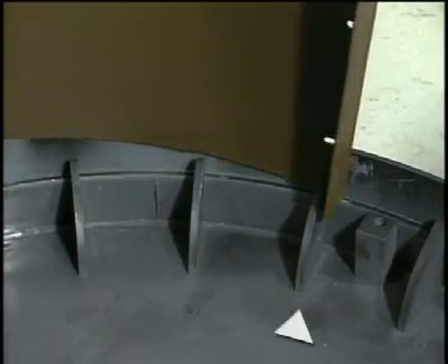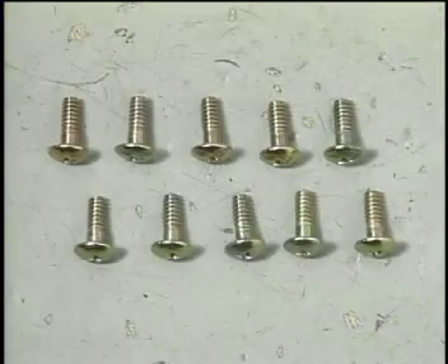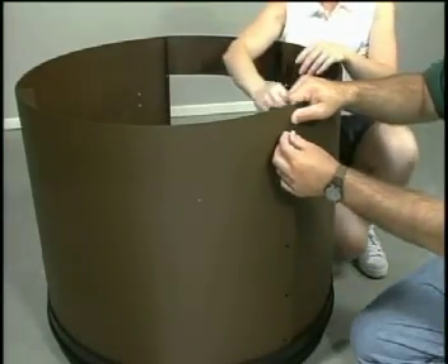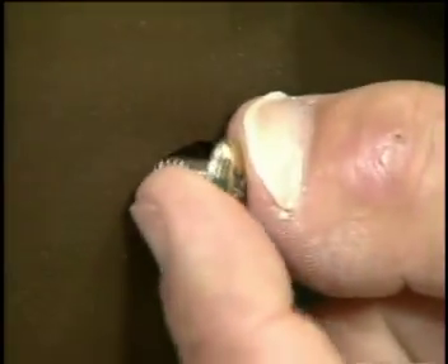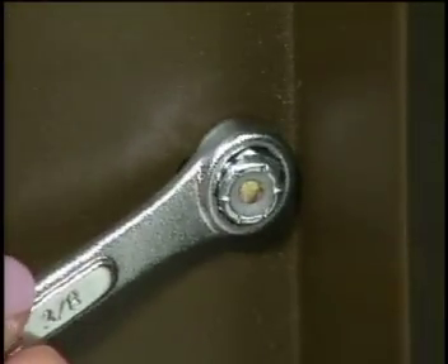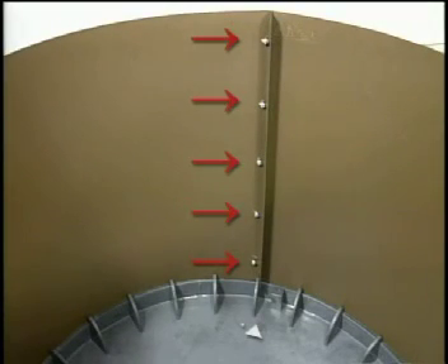When finished, take the completed drum panels and drop them into the alignment grooves in the end cap. You'll see an arrow which shows you where to begin the wrapping process and where to finish it. Next you'll need five number-ten shoulder screws and five number-ten nylon insert lock nuts. Place the screws through the alignment holes and tighten as shown — aligning the flaps of the drum panels will make it easy to push the screws through. You can use a three-eighth inch socket wrench to wrap up the tightening process, but remember: don't over-tighten, keep it loose. Repeat the process until all five alignment holes are screwed together.